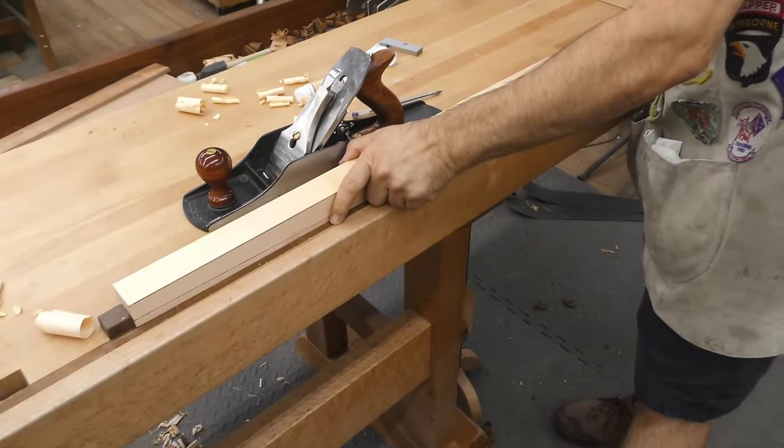You can get to the point where you do this by eye and get them nice and even. I'm looking at the width of each chamfer — this one needs a little bit more, this one a little heavier on the left, and I'll take this one from this point to that point. This one is referenced off the taper, that one off the square surface. You don't want to interfere with the reveal when it's assembled, so bear that in mind. If you ended up taking the taper up too far, you could come in and plane the flat a little bit just to bring it back. The final step would be just to plane those off.